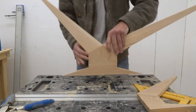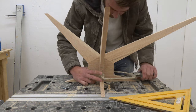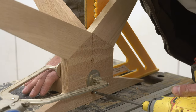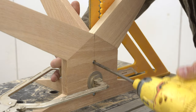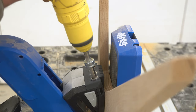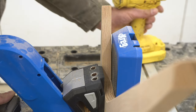I made sure that this third leg was sitting really square and was perfectly centered in the hub. Then I screwed it in, making sure to add wood glue to the joint. I used the same inch-and-a-quarter fine thread pocket hole screws that I've used throughout. The fourth leg connects with pocket hole screws, so after I drilled a couple of pocket holes, I connected everything with glue and screws also.